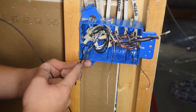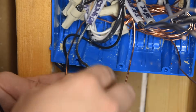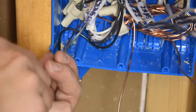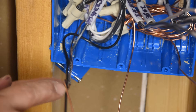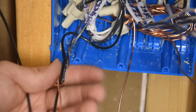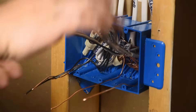Our first device is ready. This wire is a little short — if it were all new I would have run it further, but it is what it is. Take the ground wire and twist it around, then put wire nuts on the ends of the black wires if you want to test the circuit — you can actually energize it to make sure everything's working before going further.